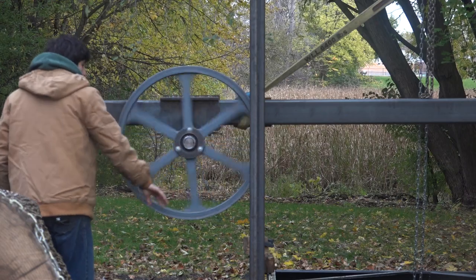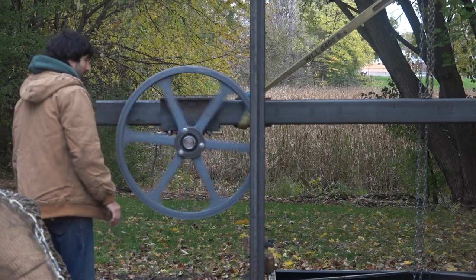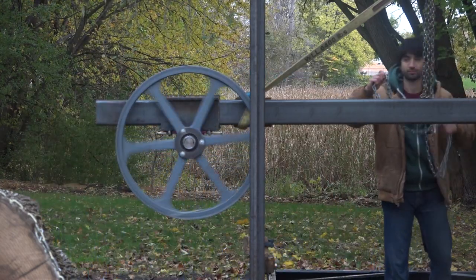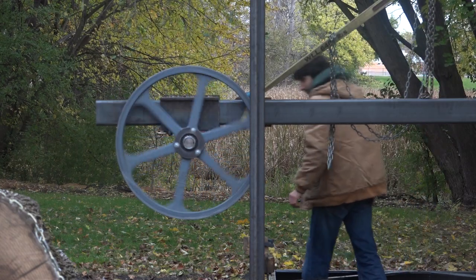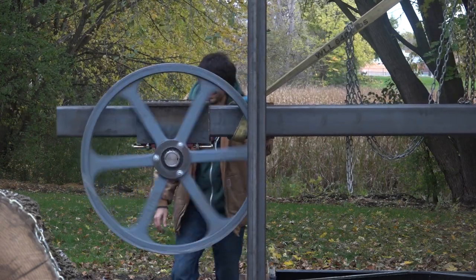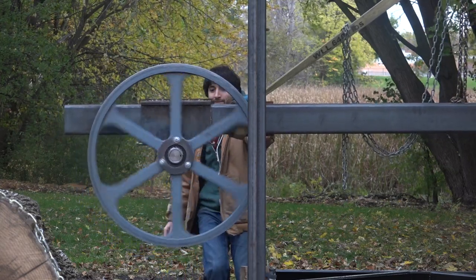The static tensioners, you'll see those as just a screw mechanism that pulls this thing out, or a hydraulic ram which just pushes against here and pushes it forward. The other way, the dynamic ones, you'll have ones that have a spring in there, something compressing a spring, and the spring is what is actually pushing on the whole box assembly here. Or you could also do an airbag or an air cylinder, something that has a little bit of give.